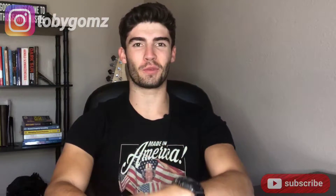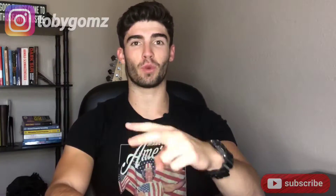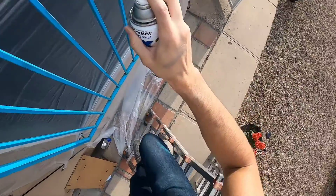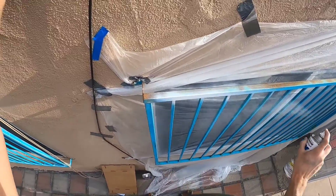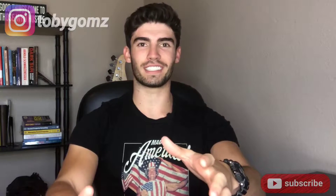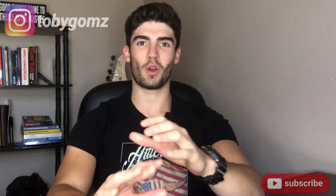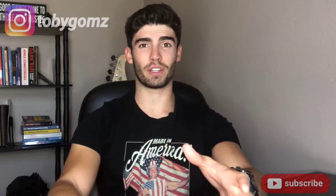The final step is to paint the wrought iron. You want to use at least two coats — one coat doesn't quite cover everything, two coats is perfect, three might be a little overkill. Use a two-in-one paint and primer that's rust-inhibiting. The one I use and that a lot of people use for wrought iron is Rust-Oleum paint and primer. That's how we're able to turn this ugly 50s turquoise that was rusty and really dull into a nice semi-gloss, rust-inhibiting finish that should hold up for many many years and boost curb appeal.